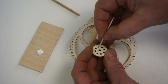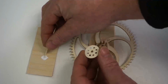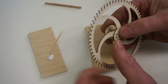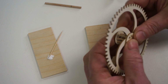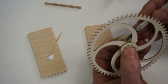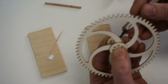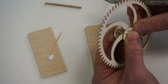Once again, do not spare the glue. Now, this is where the fun begins. Keeping a constant pressure on the end piece, maneuver the pins so that the beveled ends grip the holes. I realise this is not the easiest part of the build, especially as your fingers are gumming up with wood glue, but take your time and it should not be such a problem.